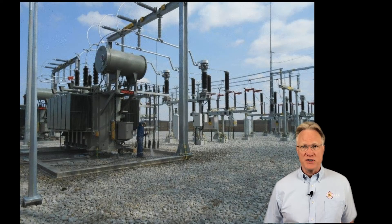Almost without exception, crushed rock is the final top layer. This gravel layer is an important design consideration for step potentials, as it acts somewhat like an insulator, so long as fines are not used and the size of the rock is consistent. In fact, some utilities will not energize a substation until the rock is in place.